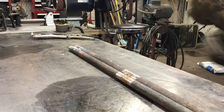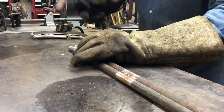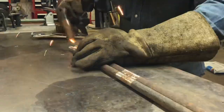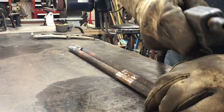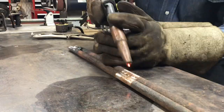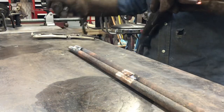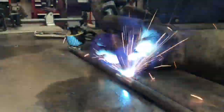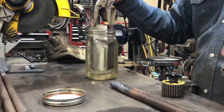As far as the handle goes, I picked this little trick up a few years ago and it made a huge difference — welding two pieces of round bar together instead of just having one piece that turns in your hand all the time. If you stack two of them together, like your knife handle when it's got a little bit of height on it and it's not completely round, it won't spin. So it gives you a little more control and also helps you counterbalance the weight of your billet.